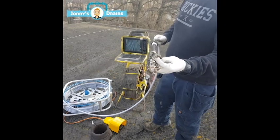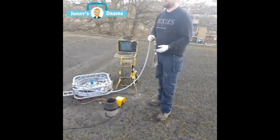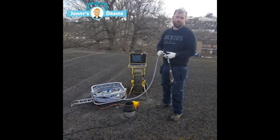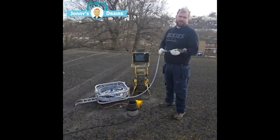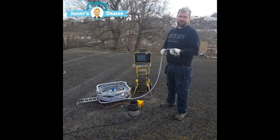We've managed today to get done — so far, halfway through the day — we've got 8 stack pipes done, all 4-inch, in cast iron, and some of them have been up to 80% encrusted, and it's done it with only 2 passes.